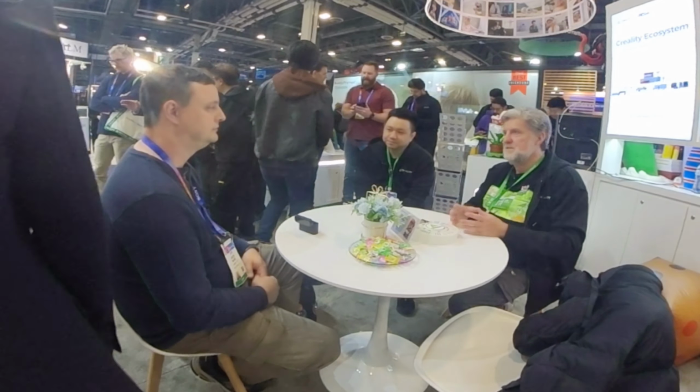So I do multi-layered colored prints often. I've made magnets and things with 0.1 millimeter layers, and it's really cool. You can do gradients, but it is nice having separate colors so you can have it all built in. Especially when doing multiple of the same thing. You just fill the plate up, and the waste is the same as for one.